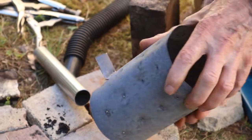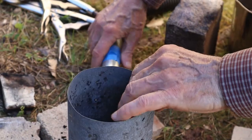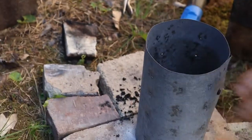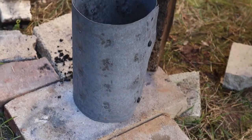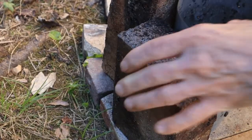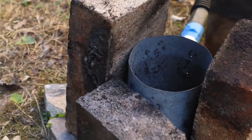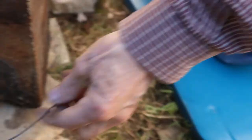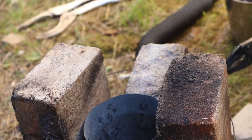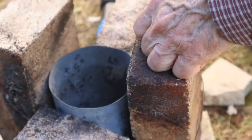I'm starting out with a piece of 4-inch galvanized stove pipe with a flap cut in it and using masking tape to attach a steel tube for the introduction of air. Previously I've made a bed of fire brick — it's as though I was required to do this in an afternoon, because I spent all of about five minutes doing this. I've got four bricks and then I'll put a little spacer brick in. Now I'm wrapping it with one loop of wire and turning it clockwise to tighten it up, and once that's done, I'll put a Z in it to make it a little tighter.